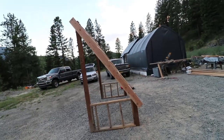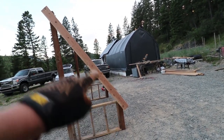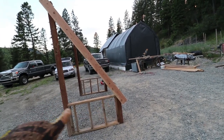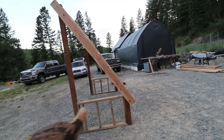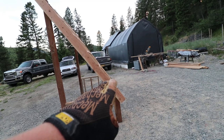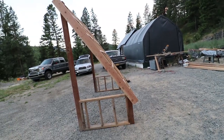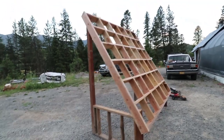It's awfully steep. I guess what I'm realizing is that on our old Grizzly, the 82 inch mark, which is what I used for this measurement, I took off our old Grizzly, and I knew this measurement because I was able to calculate it based on the 2 foot knee wall. And on a right triangle, that's the exact measurement. I have a hunch that on our old Grizzly, this wasn't a right triangle. I think this leg was a little bit long, and so this angle wasn't actually correct mathematically. In order to make 82 inches work, we would have to raise this up and come out. I can either sit back and do some more math, or we can move ahead and give this a try and see if it actually will work pretty well.